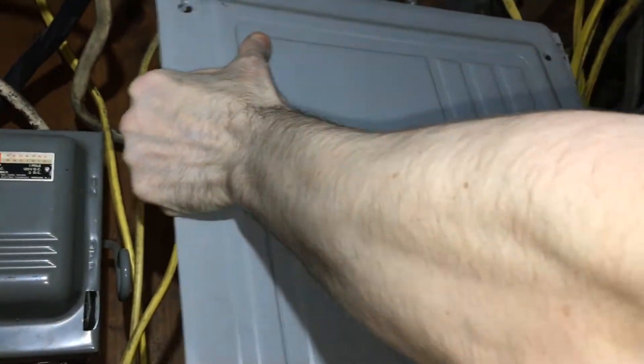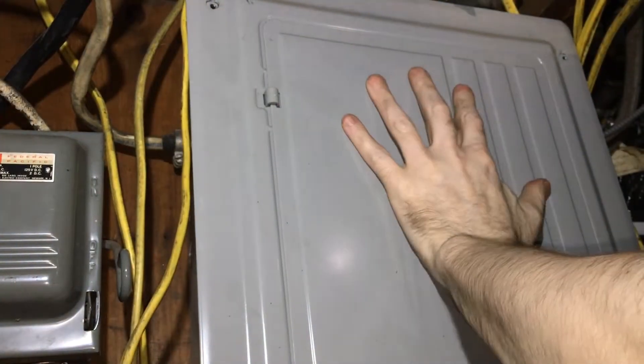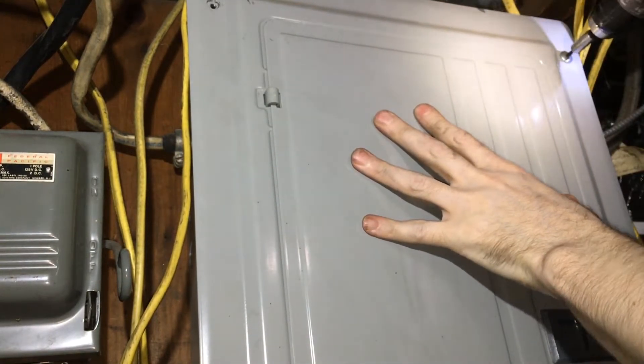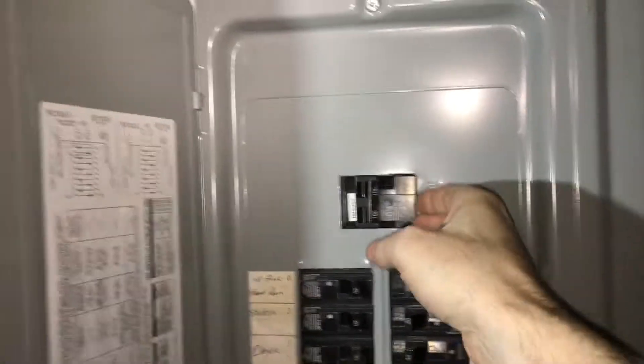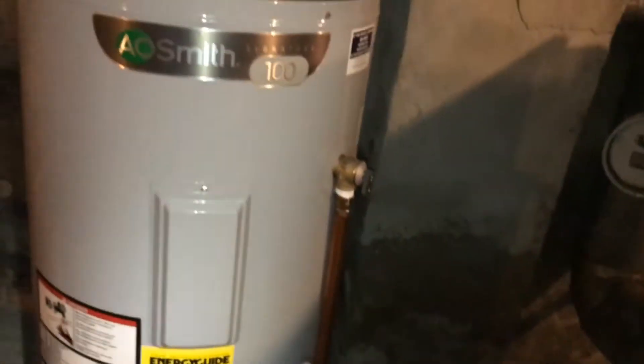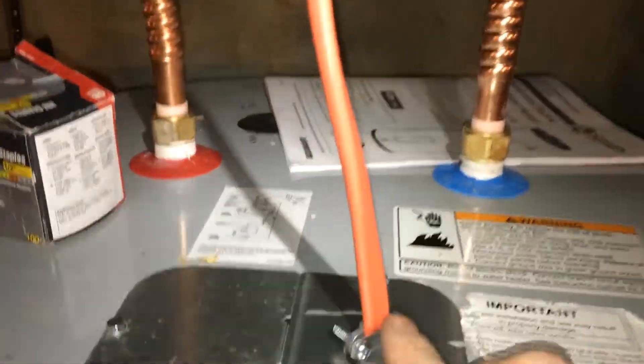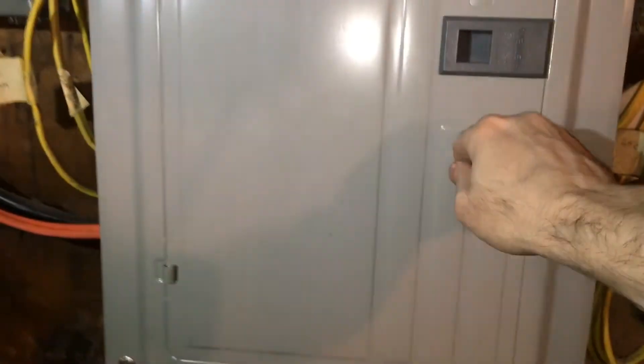The cover has helpful little tabs so one person can do this — it holds up the cover. Let there be light! Now most importantly, this tank is already filled with water — you cannot turn the power on when the tank is empty because the elements will burn out. Since it has water in it, I'm going to turn it on and that's going to start heating the water right away. That's how you put in a new breaker to finish the electrical work on your water heater.